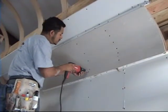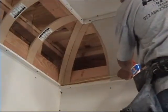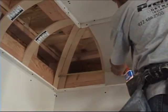When you come to the corner of the room, a corner piece of drywall must be cut to fit up against the corner cove piece. Step five: take measurements of the corner cove every few inches apart.